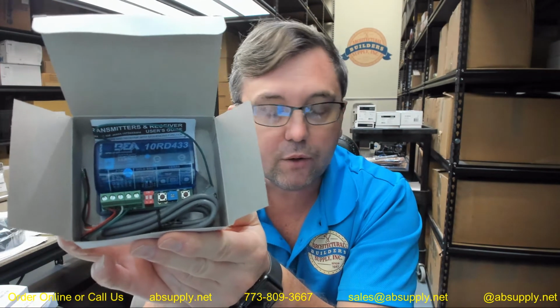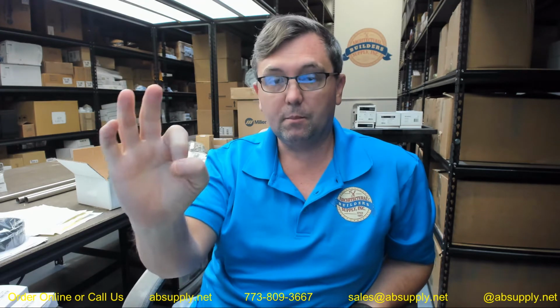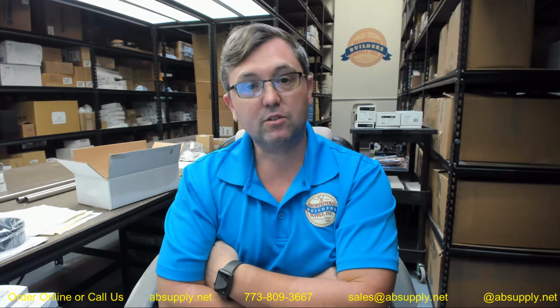The final item to review really is the receiver, and that's going to be connected up to most likely your automatic door. I have people that install these with electric strikes as well. You can order from BEA keychain style transmitters. They're literally going to look like that other transmitter, just with a keychain over it, and all of it's contained. It wouldn't be a 9-volt battery. It'd be a 3-volt battery, like a battery you'd see on a computer board, the flat disc style batteries.